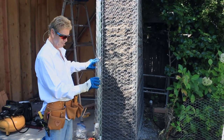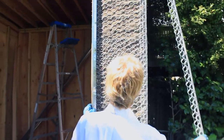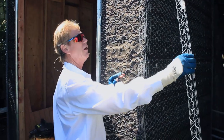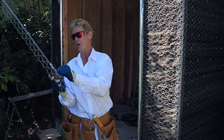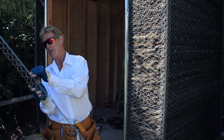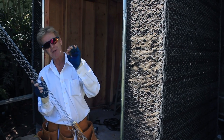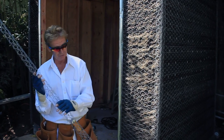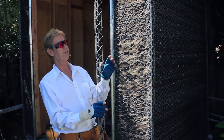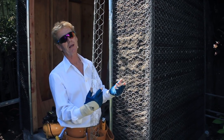A couple other things: if you're going to place a J-trim, usually put it under the paper. Dan's got this all set nice and the corners are flat. I usually tell all the contractors and GCs we work for: do the paper and the wire, do the membrane, watch our videos if you don't know. We're happy to come in and just do the cement work. Most GCs I tell don't do the corners, because that takes a little practice.